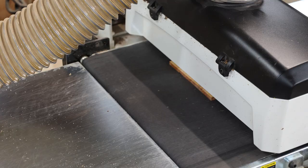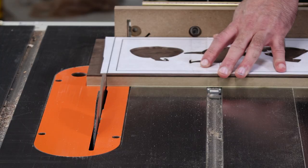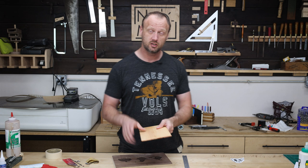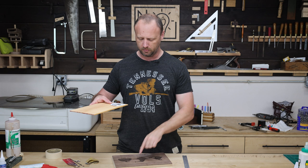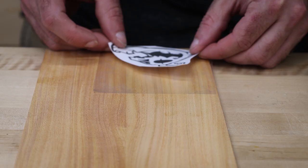We need a lot of orange — pumpkins, right? The silhouette looks really good, and I have my orange wood. This I believe originated in Argentina, so it's a really beautiful wood, especially when we put finish on it. The pumpkins aren't very big so I don't need a whole lot, but I'm going to stick them onto my pieces, cut each of them out, and glue them into place. This wood is not quite a quarter inch — more like three-sixteenths — I just needed it a little bit higher than my background, which is one-eighth inch thick.